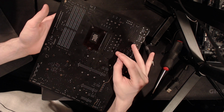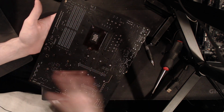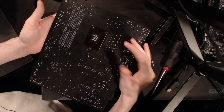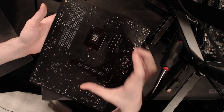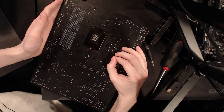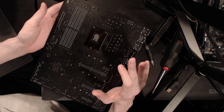Now with the ISL6617s, these chips actually do that for each of the 2 phases that they have hooked up to them. So the voltage controller still sees a 4-phase, because it literally doesn't have more inputs than 4 for the vCore section. But the ISL6617s, each of them is actually capable of taking a PWM signal from the voltage controller and changing the actual duty cycle for the given phase to make sure that they are as close to balance as possible. So that's really, really cool. And basically this makes this an 8-phase. As far as I'm concerned, this counts as a true 8-phase.